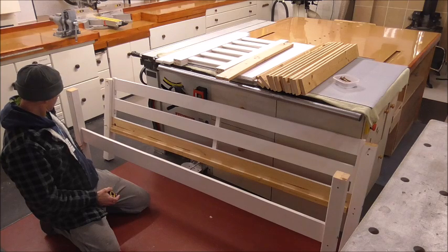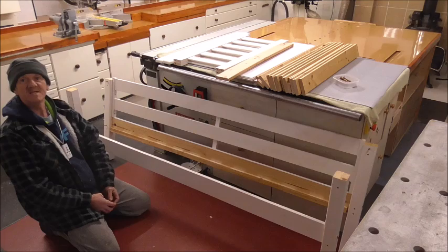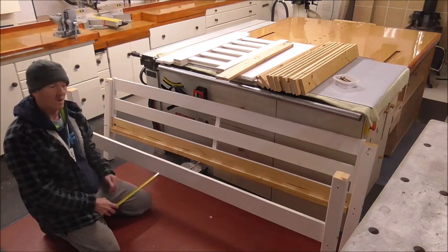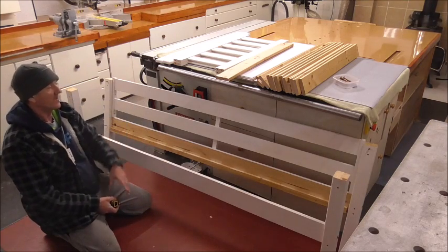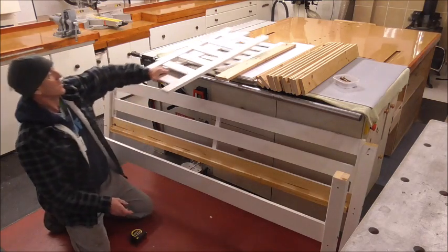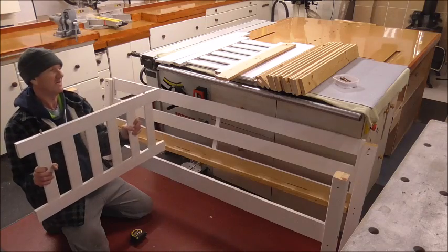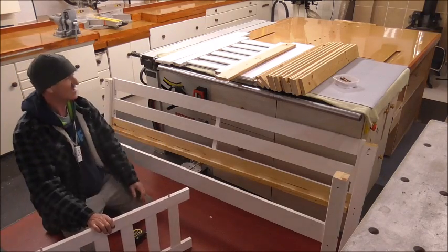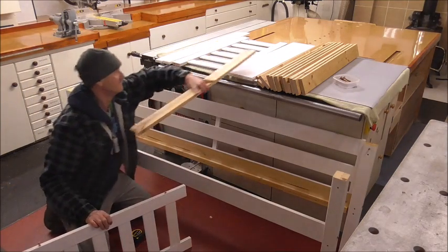At the bed end side, I might shape it, like it's tapering into this smaller leg. The other end is going to sit on the wardrobe, cut clean off. So we can deassemble that and play around with them, and then cut all these down to 750. Also on 750 we have these which fit on the head and bottom rail. These also want the same 150 taken off them. We shouldn't need to do any measurements because everything equals. If that needs 150 off it, it all needs 150 off it.